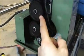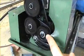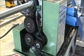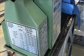I've now changed the gears. I've got a 60 here and a 45 here, and I've got two 50s there — it just fits nicely. Let me show you the actual length of the job I'm doing. It's a large lead screw for the CNC machine I'm building — that's a 2 metre length of rod.